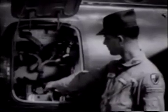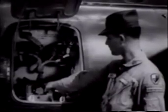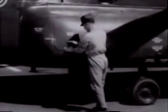The Chinook is the first Army helicopter with a dual alternating current electrical system. The two alternators each supply 208 volts of three-phase, 400-cycle current to two separate circuits. If one alternator fails, the other automatically supplies the entire load. For components requiring direct current, dual transformer rectifiers are situated in the forward end of the left pod. A nickel-cadmium 24-volt battery is located in the same compartment. It supplies emergency DC power and starting ignition for the APP. The Chinook's AC system delivers more watts of power per pound of system weight than a DC system.